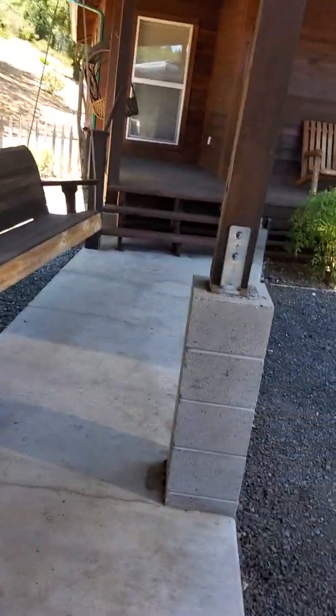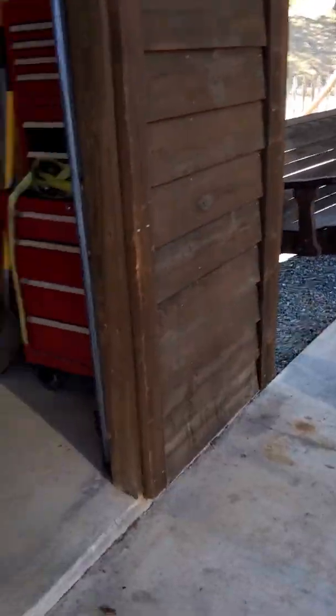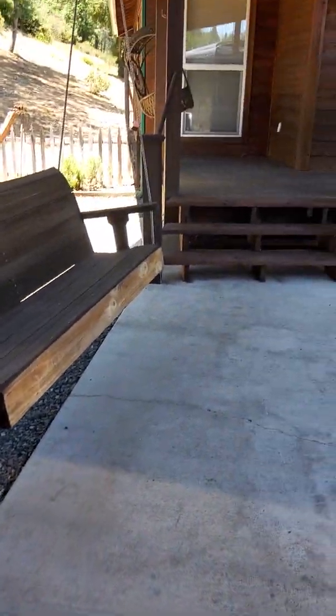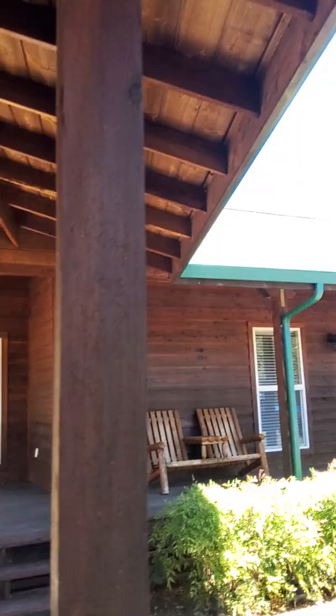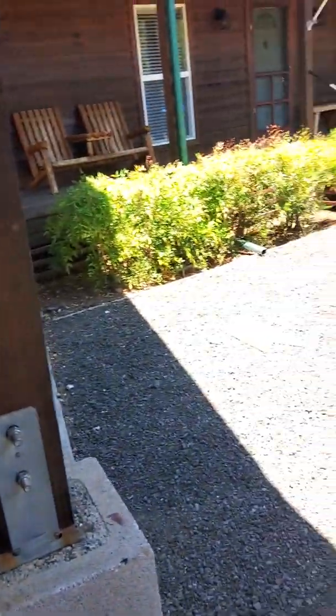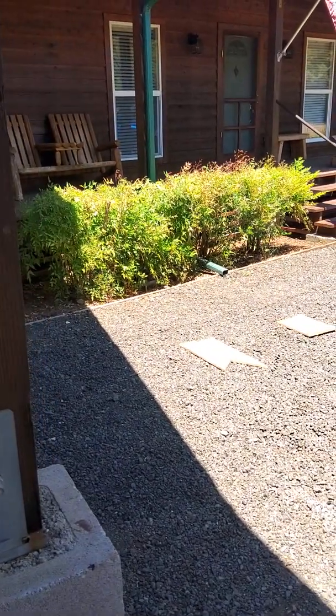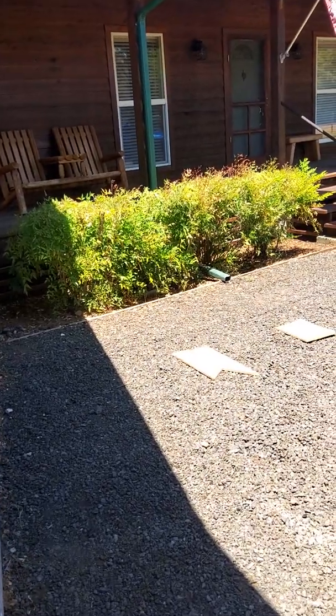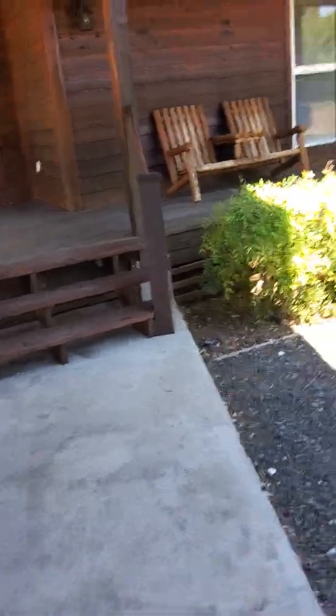All right. So through the, technically, I guess you call it a breezeway. Either way, this is pretty good. This type of siding, you have to stain. You got to keep up on it, but it's in pretty good shape. You can probably see the roof from here. You can probably see how it's starting to go a little bit. It's just kind of hard to show it on the camera. I have my drone up there, and I actually walked it too. So you got full ridge vent up there. When you have ridge vent, you don't have gable end vent, because it kind of just defeats the whole purpose of gable ends if you have a ridge vent.